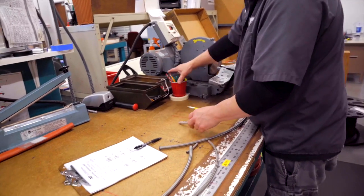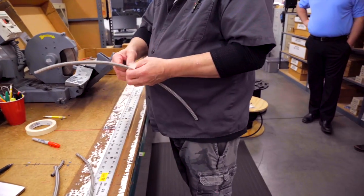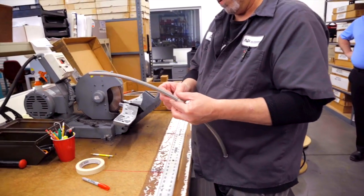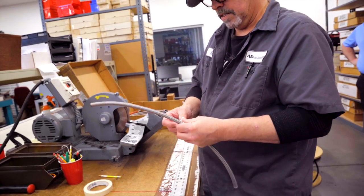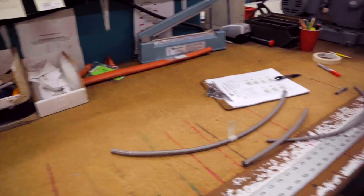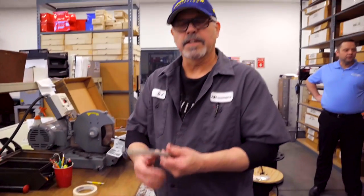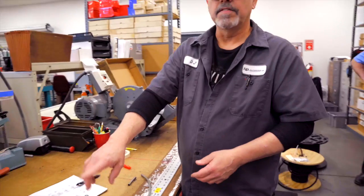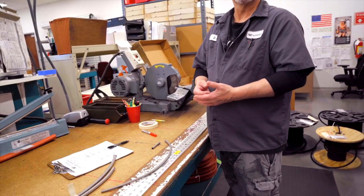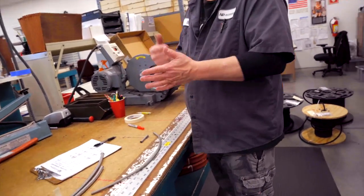This one's a straight to 90. What we do when we mark this as a straight to 90 is we'll put this tape on here like this — that tells us it's a straight to 90. This is a straight to straight because I marked it with the tape. Then if it's a 45, we'll just run tape around it in a circle instead of leaving a tab hang off — that means it's a straight to 45. We'll put it together and we know what it is.